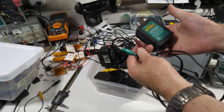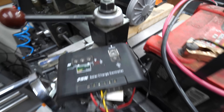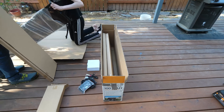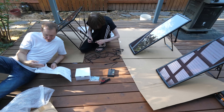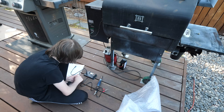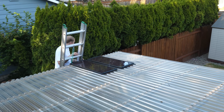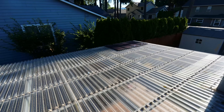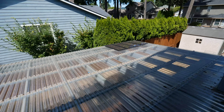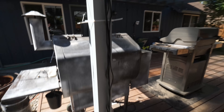But we can do better. I've got old solar panels tucked away, but in my last video I let the smoke out of the one solar charge controller I had left. Fortunately, my dad left a couple of solar kits he bought years ago for emergency use and never took them out of the box. So I'm grabbing one and making a father-son project out of it with my son, seeing if it actually works. These panels are so heavy, I think they'll be fine just resting on the relatively flat roof of the patio. Realistically, just one of these 25-watt panels should be enough, but cloudy winter weather will drop solar output to a third or less of summer levels. Going overboard with 100 watts of panels and 9 amp-hours of battery, my grill should be able to run regardless of what the grid is doing.